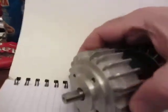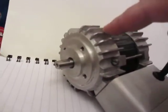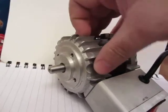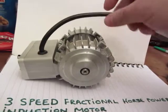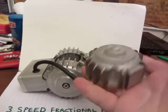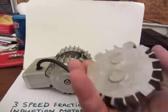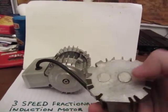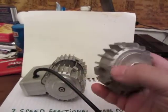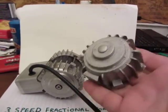These castings — which I've got my finger on — came from the casting work we were doing in my other videos, which you can see on YouTube. That's the back one. They started off as raw castings; you can see where my runner and riser were, where I've cut them off. They were bored out on the lathe — you can see that in one of my videos if you search my channel.